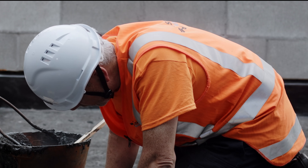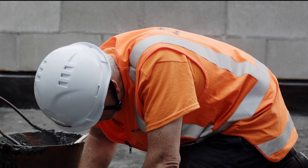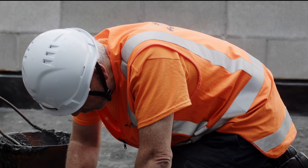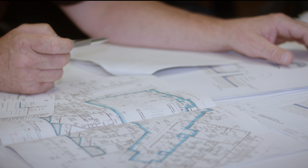Outlets should be cast bronze metal type. They should be primed, then two layers of mastic asphalt should be applied. Mastic asphalt should not be applied to PVC pipes. All specialist detailing will require consultation.